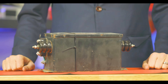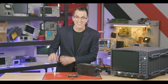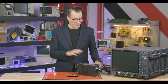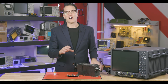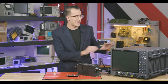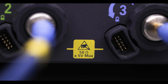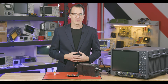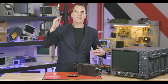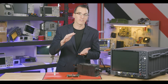I have this 12kV Neon Sign Transformer and this 9V battery — one of these is a safe input and one is not. Actually, I'm just kidding; I don't want to die and more importantly I don't actually want to blow up my equipment. To avoid blowing up your equipment this way, don't exceed the maximum input power or voltage on your gear. When connecting to an unknown signal, start at the lowest sensitivity and work your way down to the signal. You always want to keep your signal completely on the screen.